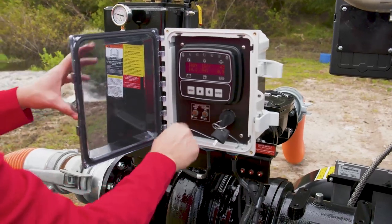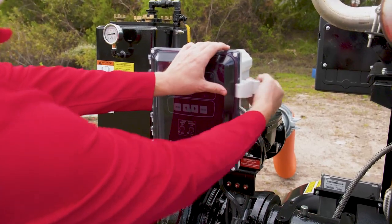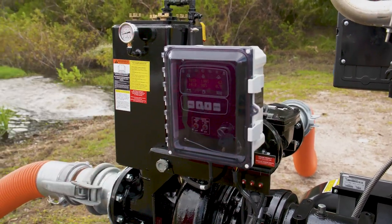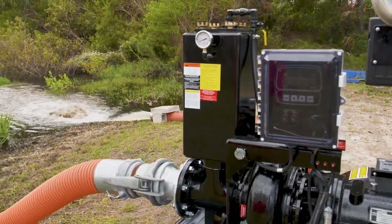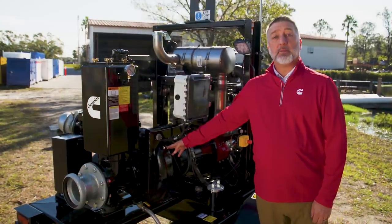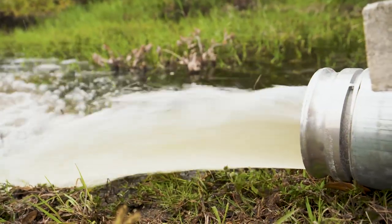Let me show you some key features of the pump. The pump is fully automatic dry priming and handles large volumes of air and water in addition to intermittent flow conditions, with automatic priming and re-priming up to 28 feet of vertical lifts. The pump comes standard with an enclosed impeller that passes up to 3 inch spherical solids.